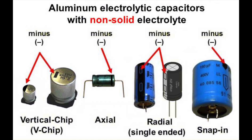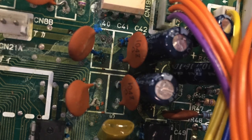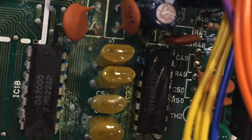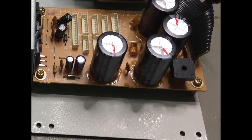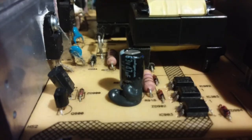These electrolytic capacitors use in their internals an electrolyte, which is a fluid that sometimes leaks out, and this is a nasty corrosive fluid that does some nasty things with your electronics. Well, to begin with, these are not leaking caps — this is just elastic material to keep the capacitors from shaking loose or causing dry joints. More on that later.